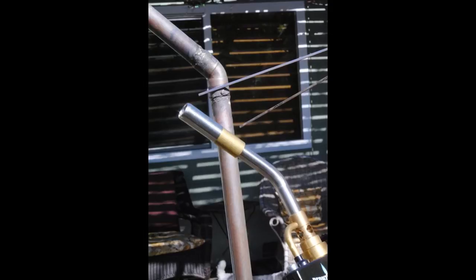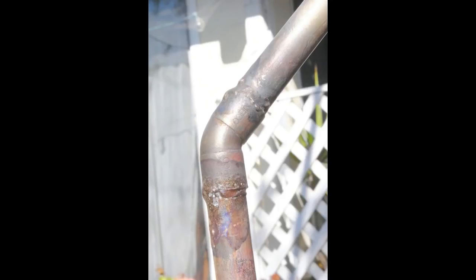Well, this is an 8-section loop made out of 10 feet of 0.9-inch diameter copper, and you braze those elements together with this. It's called Silvaloy, and Silvaloy is available for about $2 or $3 on eBay, and it's 80% copper, 15% silver, and I think 5% phosphorus. And you use very, very hot brazing to get it on there, but it's easy to do.